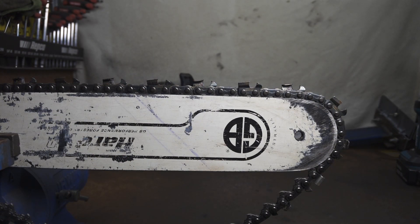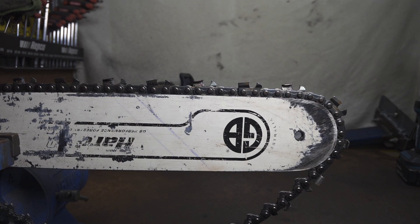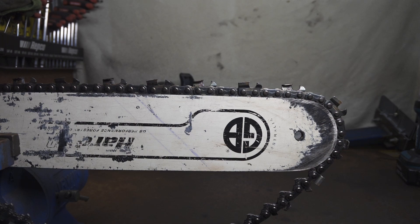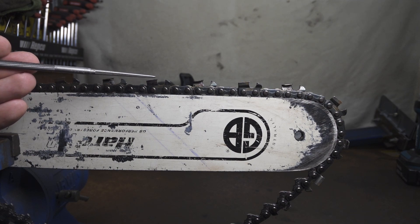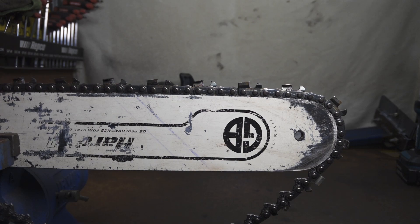The first element of sharpening we need to deal with — the same as when sharpening a crosscut saw, bandsaw blade, or circular saw blade — is a process called jointing. The basic version of jointing is that everything is set so it is level in height. With saw chain, jointing is usually done during the filing or grinding process itself, because chainsaw cutters have a top plate clearance angle — they taper in height from the front of the tooth to the back. That's the reason we have to adjust depth gauges: as they sharpen, they become lower, and that takes care of the jointing process.